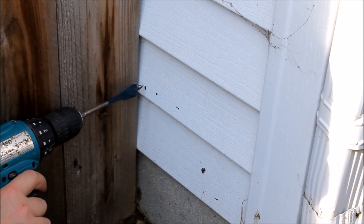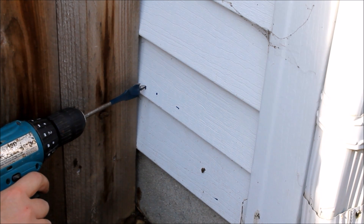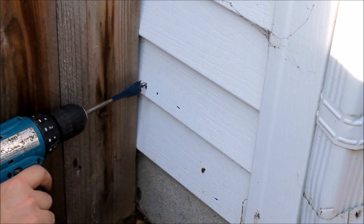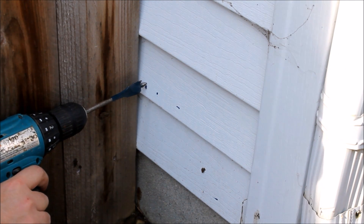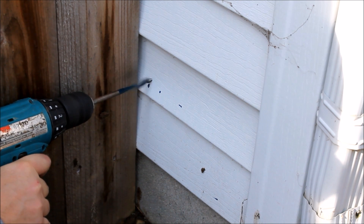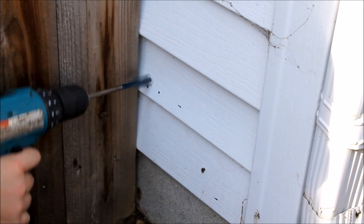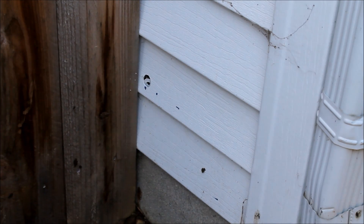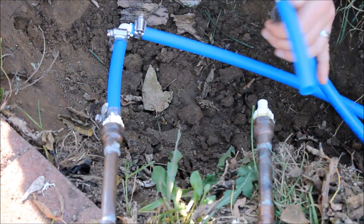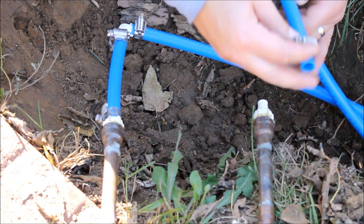So we're up here at the house at the back corner of the garage, and I'm just going to make a couple of holes here. I need to come up from the bottom of that siding - I've got a general area of where I need to come through in the garage. Whenever you're drilling through siding, just get your hole started and spin it backwards. That way you don't end up grabbing the siding and messing it up real bad. It's windy today, so I apologize as always.